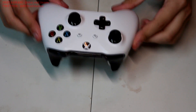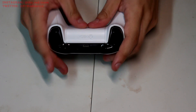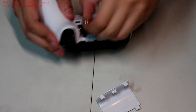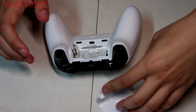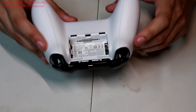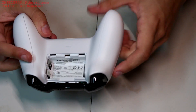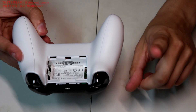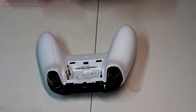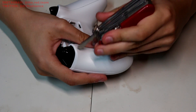Now here's where it gets really fun — we're going to take this controller apart. Pretty much you just want to take off the batteries. There are going to be a couple of screws: two up here, two down here, and one right in the center. You'll need to cut out the sticker and take off the side guards. There are special tools you can get on Amazon, but I'm doing it the old-fashioned way.